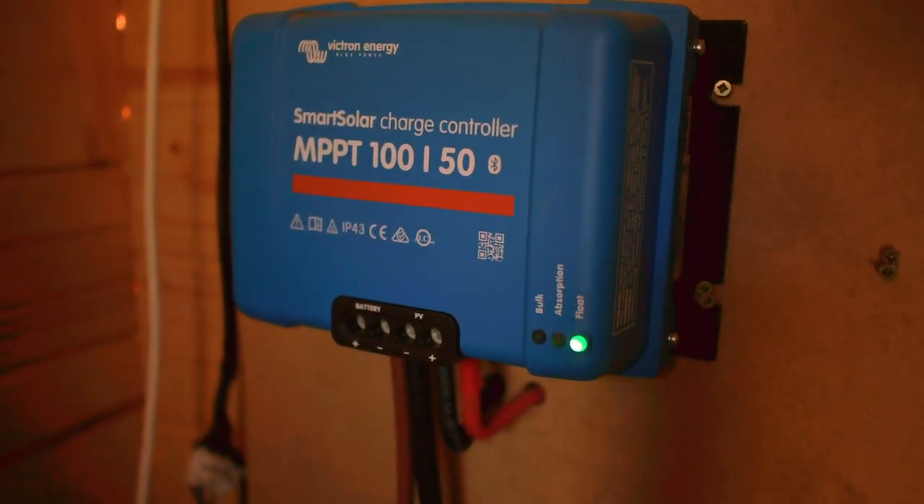Once you have your solar panels purchased and installed, the next thing you'll need is a solar charge controller, or MPPT. A charge controller helps make sure that the voltage is right for your batteries to charge optimally all the time, and an MPPT is just a better form of charge controller. The sun shines at different intensities throughout the day, creating a different voltage output from your panels all day. Just because they're 12 volt batteries doesn't mean the panels produce 12 volts — in fact it's usually quite a lot higher. So a charge controller modulates the voltage to create a solid, consistent voltage for charging your batteries, and adjusts the current to get the most out of the available sunlight.